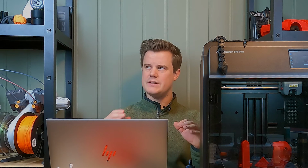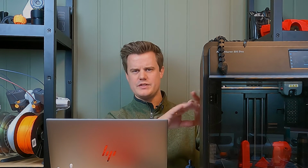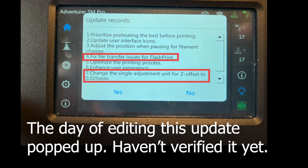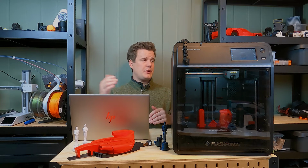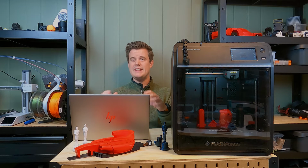So it appears that the Wi-Fi transfer might be using some other auto leveling that was done in the past, or maybe from the startup and configuration of the machine, something that is on board instead of running a new auto leveling. And I base this on that it feels like the onboard printing has a different adhesion and does it very, very well, while the sent one is completely different and sometimes quite bad. But although I found out that it may be something with the Wi-Fi, I have made some changes in the slicer just to get adhesion perfect.